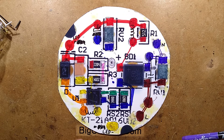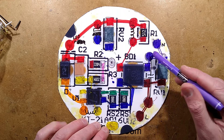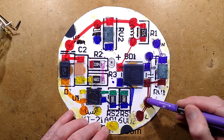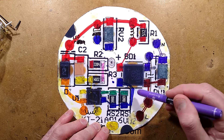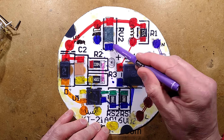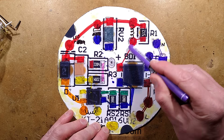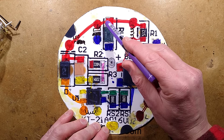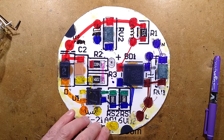Here's the other side of the board. The incoming supply — live and neutral — goes to the capacitor pins, then there's a metal oxide varistor, and then it goes to the bridge rectifier. There is a track on the other side going over to where we've got the inductor in series on the positive going to the capacitor, and then a metal oxide varistor across that.